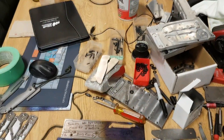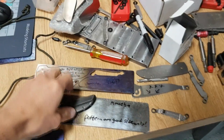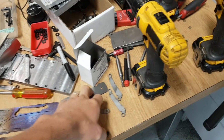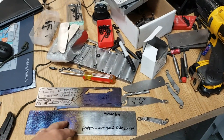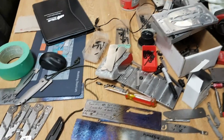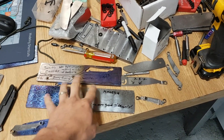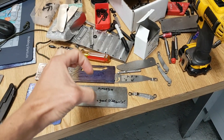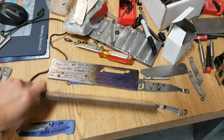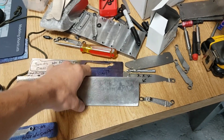The other thing with Tymascus is that it tends to be a lot thicker. It comes in all kinds of various thicknesses. Usually I buy 125 titanium or get it surface-ground to 125. Tymascus is usually 140, 150, 170, 180 — and it's all variable. When John Walker from Alpha Knife Supply makes it, I think he starts from round bar and then squishes it flat, then faces it. You can see face-milling marks. He's not going for perfect thickness — it doesn't really matter to him.